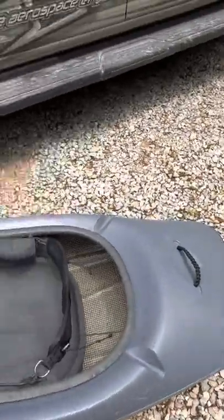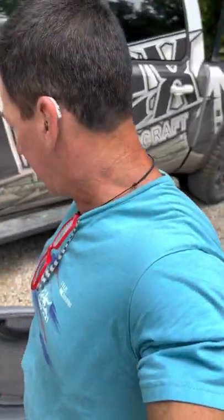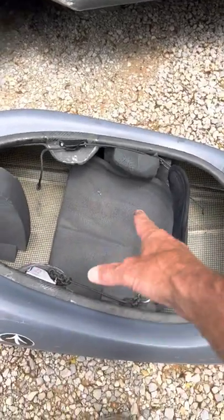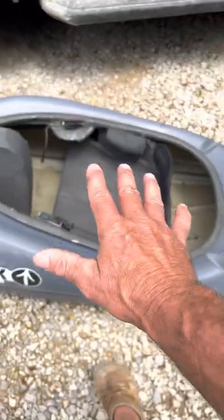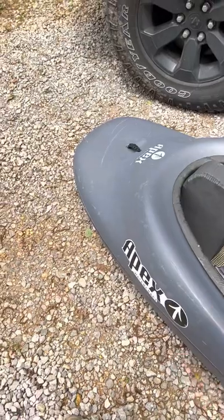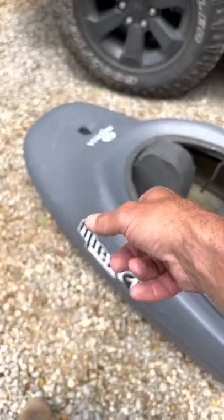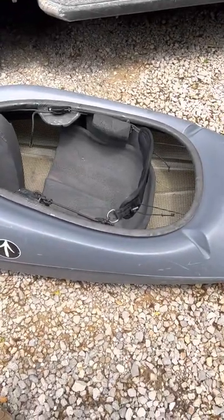Rule number one: total weight concept. Every single piece in this boat is weighed — I weigh my gear dry and wet. Sweet Cheeks are an unbelievable butt-molding system, but anything like that soaks up water and adds weight. This boat is 17.5 pounds as-is, ready to paddle. It was 18.5 pounds when I had the happy feet, sweet cheeks, happy seat, and happy thruster installed. We saved a pound right there — plus I raised the seat up an inch.